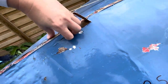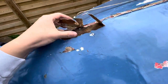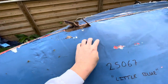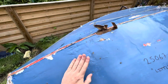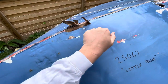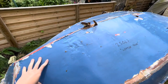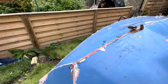All this tape — it looks solid there, doesn't it? But it's not; you can peel it off with your fingers because everything is absolutely soaking wet and rotten in there. These have all been patches. This dinghy has been slightly abused by the trailer — I'm going to talk about that in a separate video — but at least two areas of repair in this area have been caused by poor recovery onto a trailer.